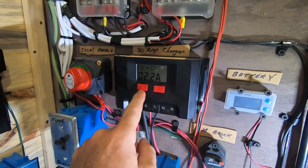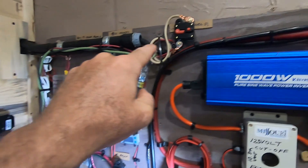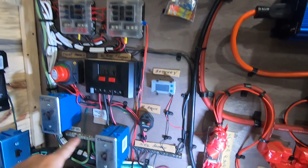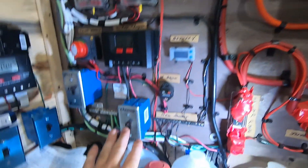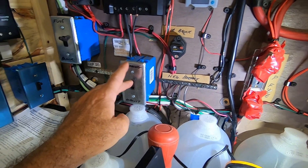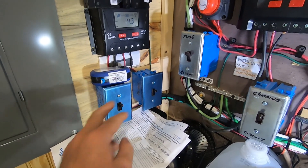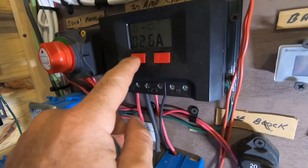We're getting 2.1 amps — that's pretty good with no direct sun. It's steady. And we're back up with a little more sun — steady voltage hitting it. That's coming from the roof, hitting the circuit breaker, coming down, hitting the disconnect, going to the charge controller. This is the fuse block switch, these are the house circuits, this is the charging circuit, this goes down to the battery bank. You can see the little arrow — it's charging. We're at 2.6 amps.